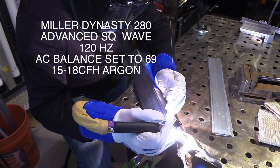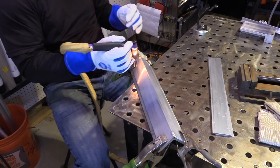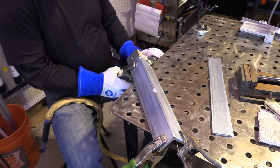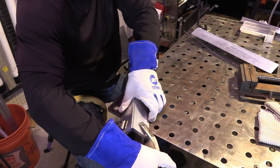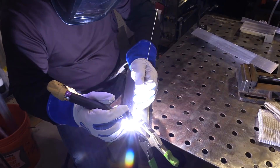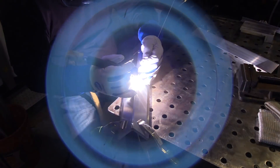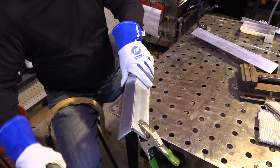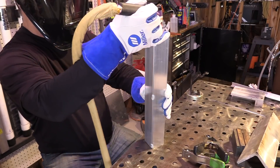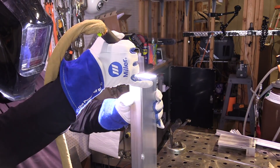I'm running this fast because no one wants to see tack welding that much, but I'm getting three tacks on each one of these pieces because they are about 18 inches long and they'll try to open up in the middle and have gaps. Even those tacks can pop loose if you don't put a little extra filler rod in there. Aluminum tacks are just really weak — you can hardly get by with light small fusion tacks on aluminum. On these corners I'm blasting fusion tacks pretty good and then I'll come back and add filler wire.